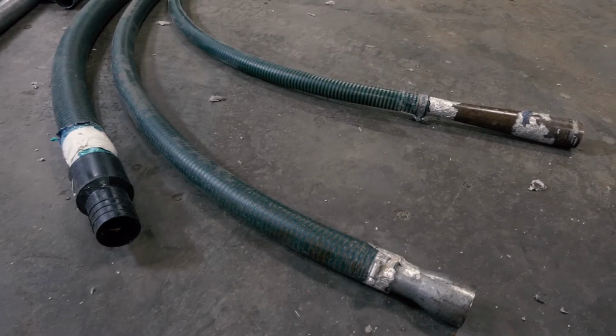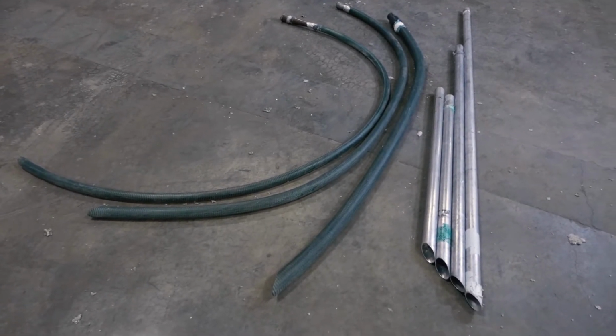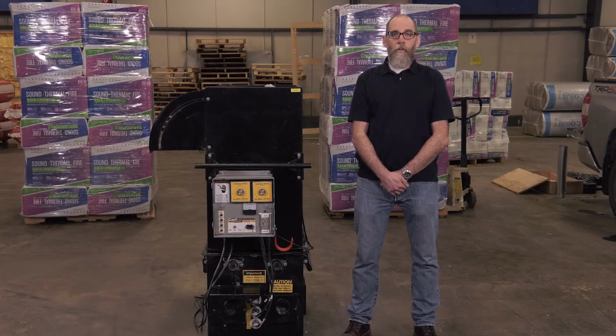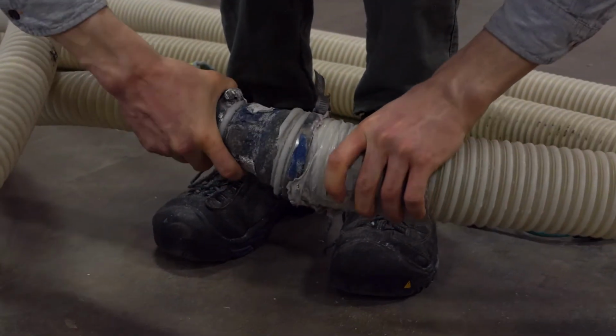A variety of hoses and tubes can be used in wall work. Flexible tubing allows us to work in existing walls through a relatively small hole, and aluminum tubes are one option when working in new construction behind webbing, before the sheetrock is applied. Various reduction fittings are used between different size hose to create a smooth transition for the material.